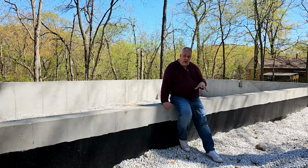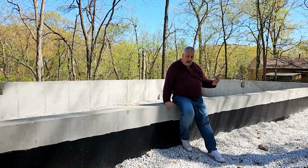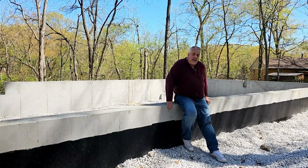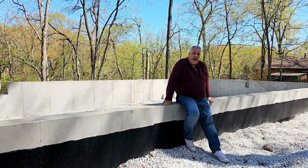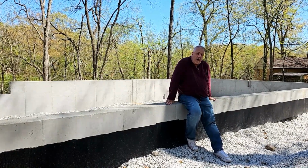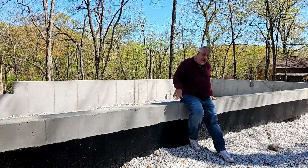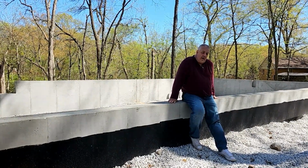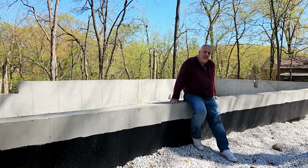And so having that large riprap stone in here allows that water to come down the hill, go through that stone, down through the 3/4 inch stone, into that 6-inch pipe. We have our waterproofing and dimple mat there, so the wall never gets challenged. Our crawl space stays dry and clean down there, and the water is mitigated. Our site plan inspector is a happy camper. Our homeowner will be a happy camper. And Jake, the builder, and myself, well, we're happy campers because it's just another solution in the book.